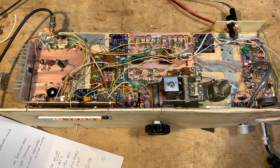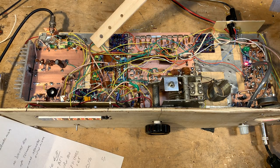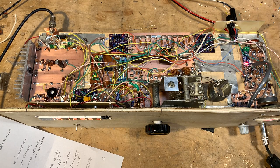The bandpass filters — here are the bandpass filters for 17 and 12. I just went with double-tuned circuits, and I used the values in the bandpass filters put out by Hans Summers G0UPL on his wonderful QRP Labs website. They work fine, tweak up really nicely, no problem at all.